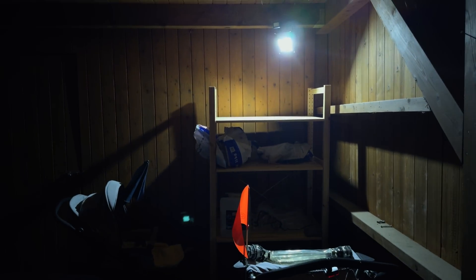Here we go - it's dark outside and there we go, the light is working perfectly! I'm now able to see outside using solar power. Inside the carport now, we shouldn't be able to see anything because I set the MPPT controller to disable the output to the miners when it drops below 10% battery. So only the outside light will stay online but everything else will go offline, which is awesome. It works!